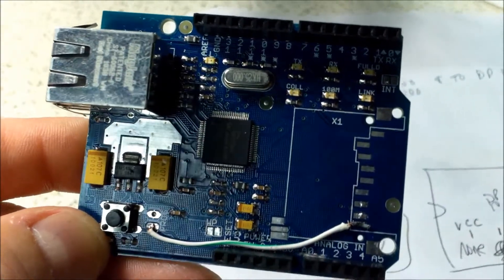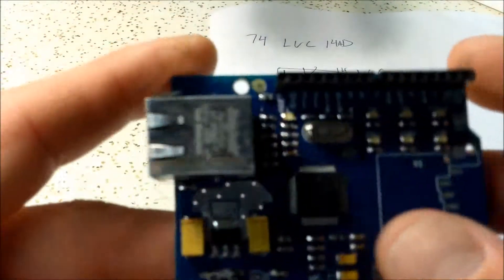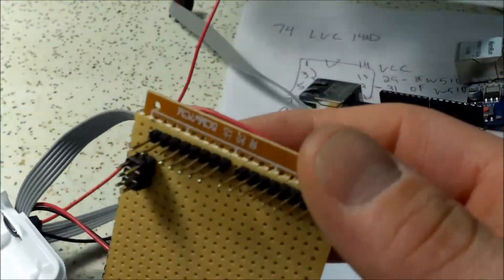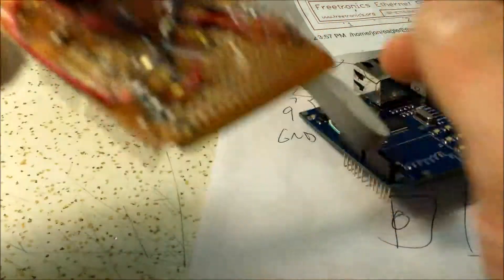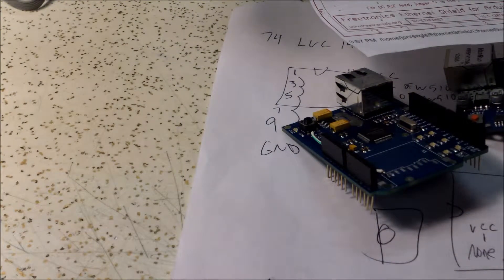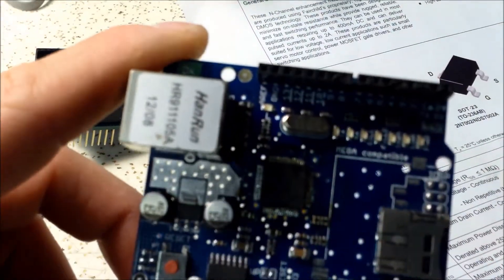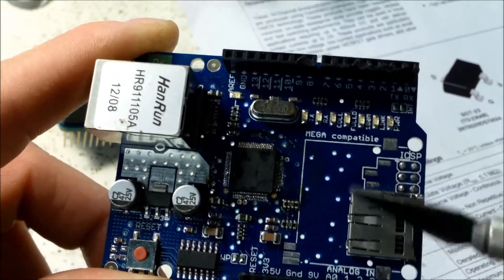I don't really like using two pins, so what I'm going to do is solder a little wire from pin 10 running up through this hole and over to where my transistor is. I also made a little converter board with pins that plug into the headers and break out to the ICSP header so I can plug it in and make it work. Anyhow, I just wanted to do a quick video on how I hacked my Ethernet Shield to allow other SPI devices. I'll put links to the datasheet and a really great website that has all Ethernet Shield schematics back to rev1, plus the Freetronics link.